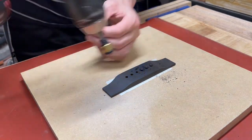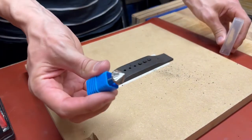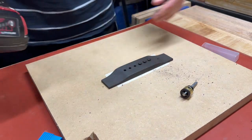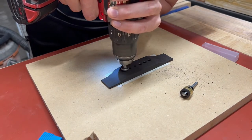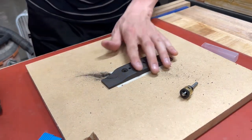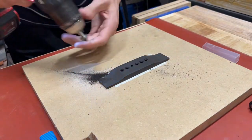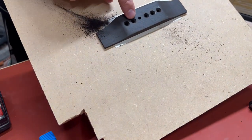I have another countersink type of tool that's not made for bridges, but I wanted to try it out anyway just to see what would happen. It has a lot of cutters on it and is actually made for tuner hole bushings — you're supposed to run it in the tuner hole before installing the bushing so it doesn't chip out a lacquer finish, for instance. I don't recommend that you do this; this is just for testing purposes. You're not even supposed to use this thing in a drill — it's supposed to be used by hand. But I wanted to see what would happen in an ebony bridge. After cutting a couple of chamfers with this tool that is not made for this, it does not do a good job. It leaves a lot of ripples in the chamfered area of the hole — it is not a clean chamfer.